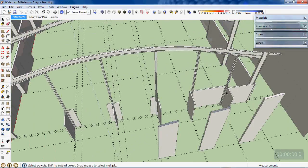These walls, as I've discussed, when they go in front or behind, so that's that one, or these ones, those ones that are going in front or behind the end bay columns, the inside face of those walls are set back 125mm off the grid line. These ones here that are on a side, beside the columns, the inside face of those are always set back 100mm beside the column grid lines.